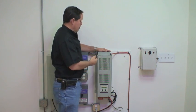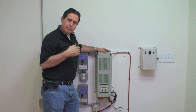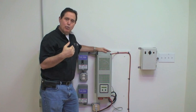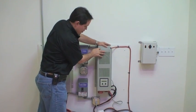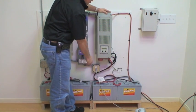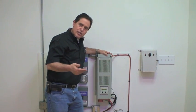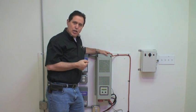You never want to purchase a system sized for exactly the load you're going to use. It's better to oversize the unit — it'll operate a little more efficiently. This system derives its energy from the battery pack, which can be as large as you need. The basic system comes with two 100-amp, 12-volt batteries. On some higher-end systems, we might use 2-volt, 1000-amp-hour batteries, depending on your situation, goals, and budget.